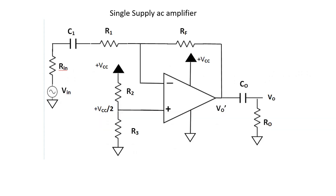Now we are going to use these concepts in our circuit. This is a single supply AC amplifier working in inverting configuration. The student asked why we have applied DC here. We apply the input here and correspondingly get the output here. Capacitor C1 is there to avoid any DC entering into the circuit, and capacitor Cout is there so that any DC inside the op-amp cannot leave the device. At V0, we are getting pure AC. But at the non-inverting input, we are getting some DC because we have already applied some DC at that point.